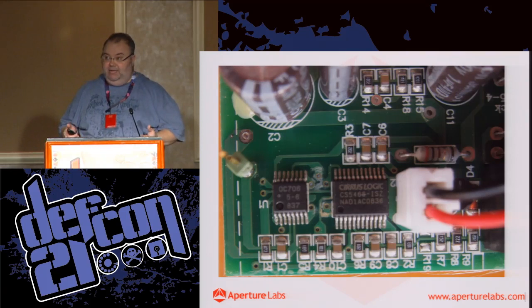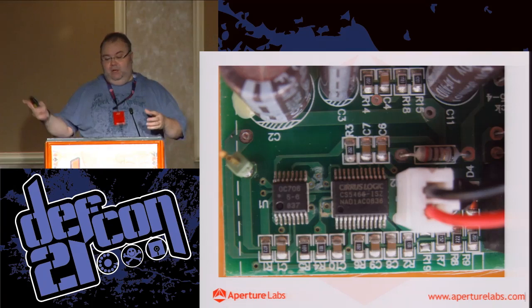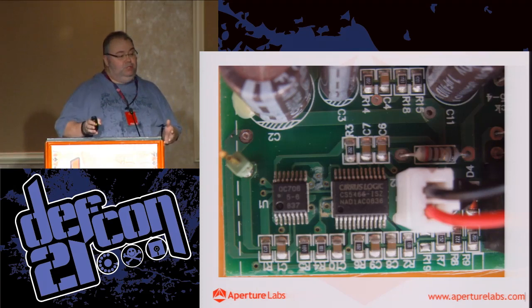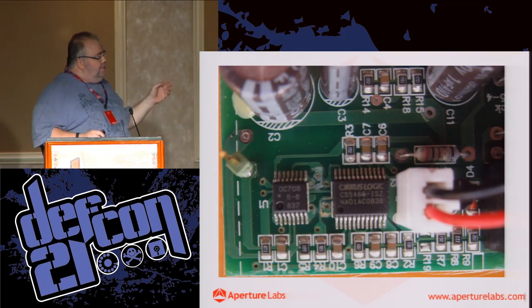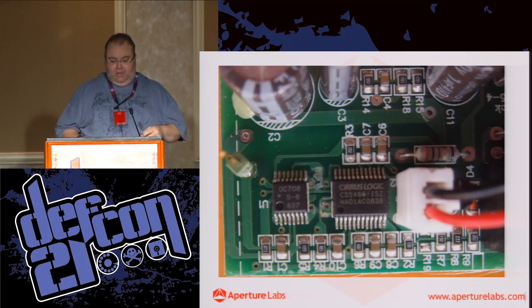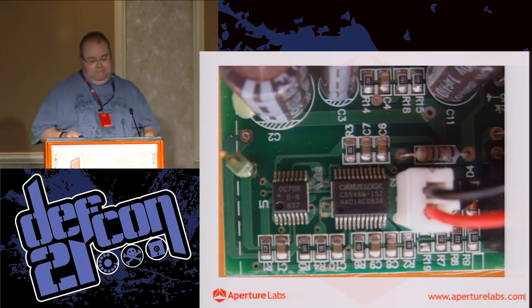Now, when you read the Cirrus Logic data sheet, this is a current frequency converter chip. So it's measuring the current across that resistor and it's outputting a frequency that's proportional to the current consumed. And it needs a clock as well. When you reverse the circuit, this OC706 chip is supplying the clock to the Cirrus Logic chip. But after a ton of Googling, and it's quite interesting because you'll actually see Google suggesting, oh, did you mean OC708? It's like people are searching for similar parts.